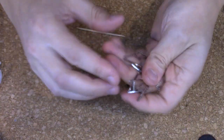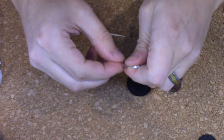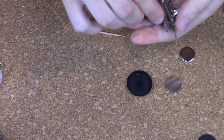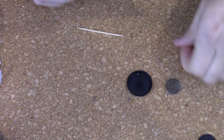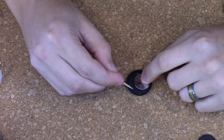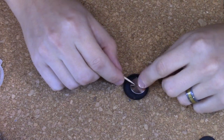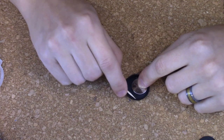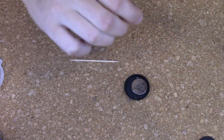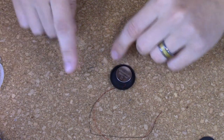Now we will need to use our magnets. Magnets come in a variety of sizes, but like I said before, we have very little room to work with. These little magnets work great, but aren't strong, so we will use 4 of these magnets to hold our battery. The concept is that the magnets will hold the coin battery in place, not only attaching to the bottom, but also creating a good connection for the terminals for the LED. The magnets are going to act as our switch. If you stick the battery in, it will turn on. If you take the battery out, turn off. It's very simple and easy. A real mechanical switch is pretty bulky and wouldn't fit underneath the base. I've seen other methods too, like magnets that turn on and off, things like that, but I like this one because it's simple.